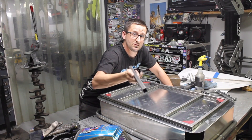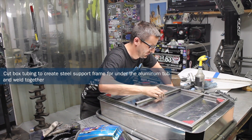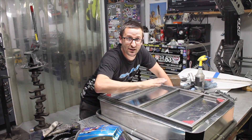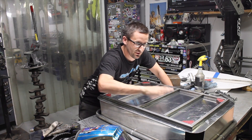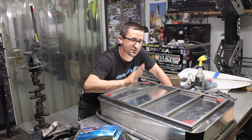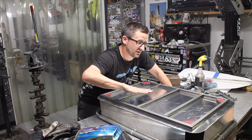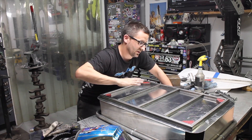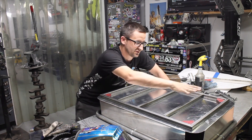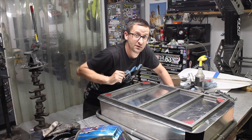We moved into the steel side of the business. This is three-quarter, eighth-inch wall — I scaled it down a little bit. We don't need one-inch box tubing; it's only a little wagon carrying a couple of buckets of dirt, so we don't need to go crazy. The scaling and size of the material just fits the idea. So we've got the cross beams — we're going to take it over to the MIG table and make all this up. This will be our upside-down foundation to build the suspension off of, where we figure out steering, rear axle, and everything.